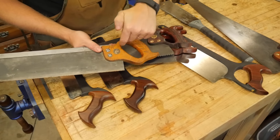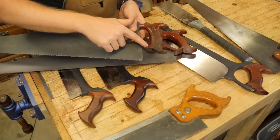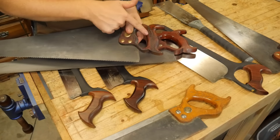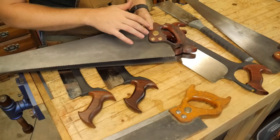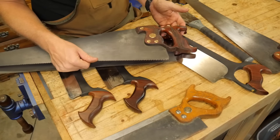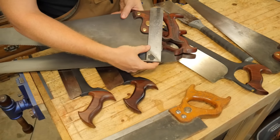For the purpose of this video I'm going to be talking about handles and plates, just giving an overview. The handle is actually one of the best places to find out information about the quality of the saw. Over time you'll learn things about the plate, but the handle gives you a lot of information — particularly about its age. A newer saw whipped out in a mill has sharp corners at the handle, and you can tell a router went in and cut out the rounded shape. Whereas with a more traditional handsaw, the radius is hand-filed and there are no sharp lines where the flat of the handle meets the round — it is completely rounded over. That tells you it's older and was probably hand sculpted.